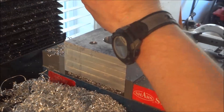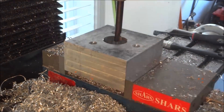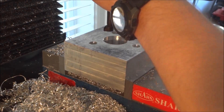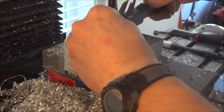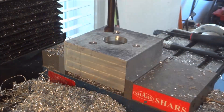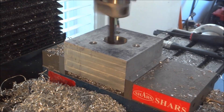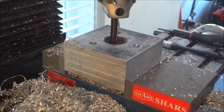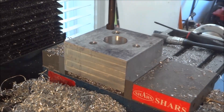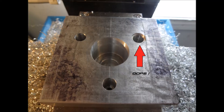Here I am raising it up and just taking a little bit, going down just a little bit, and then I'm going to check to make sure that my bearing fits with the actual bearing. Even though you're measuring, you still need to check with the bearing. I'm only going down about 3mm here because I know that the bearing cover is going to go down there, so the bearing's not going to actually be in there — it doesn't really matter. Looks like the bearing checked out — it was a good fit — so now I'm going all the way down for the final sizing of the bearing pocket. This bearing pocket actually turned out really well. And you can see my little mistake on the mounting hole.